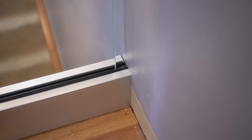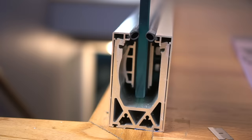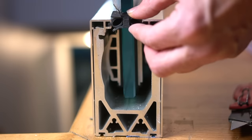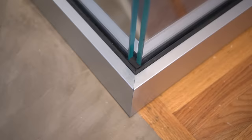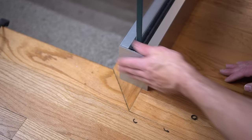Now that we're fully secured, I can install our gap fillers. This is just a simple black rubberized product that fits perfectly between the two pieces of cladding — you cut it to size, which is super easy. I actually cut the top portion of each gasket just to give it a more seamless look at the very top, which I personally thought was more eye-appealing than a larger rubber flap. Let me know what you think of that decision in the comments below. As for the end cap, I apply a bit of silicone to the base rail and then insert the cap in place. Once it's dry it's fully secure, and if it doesn't stay, just add a bit of tape and take it off later.